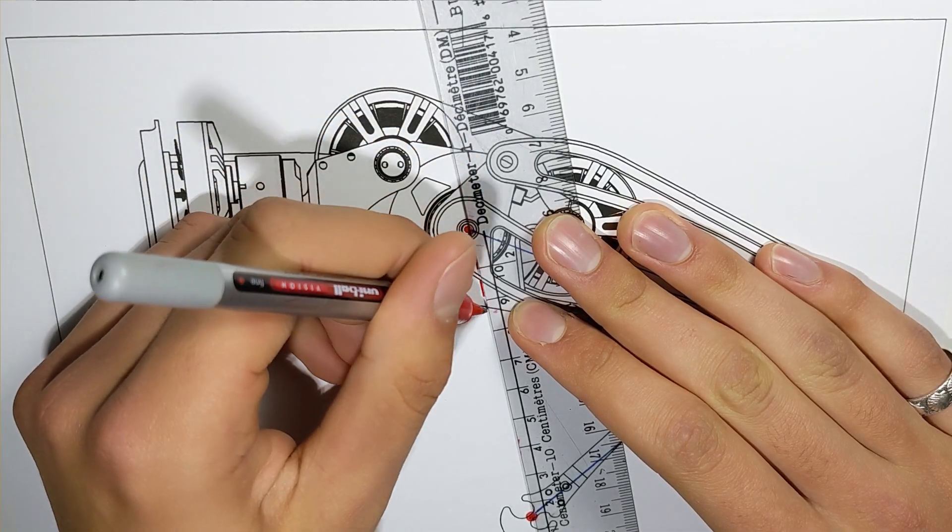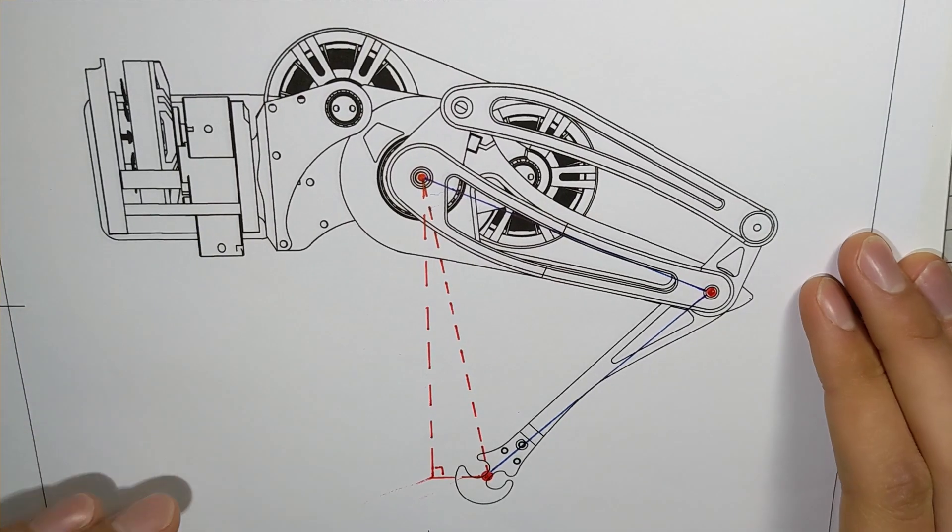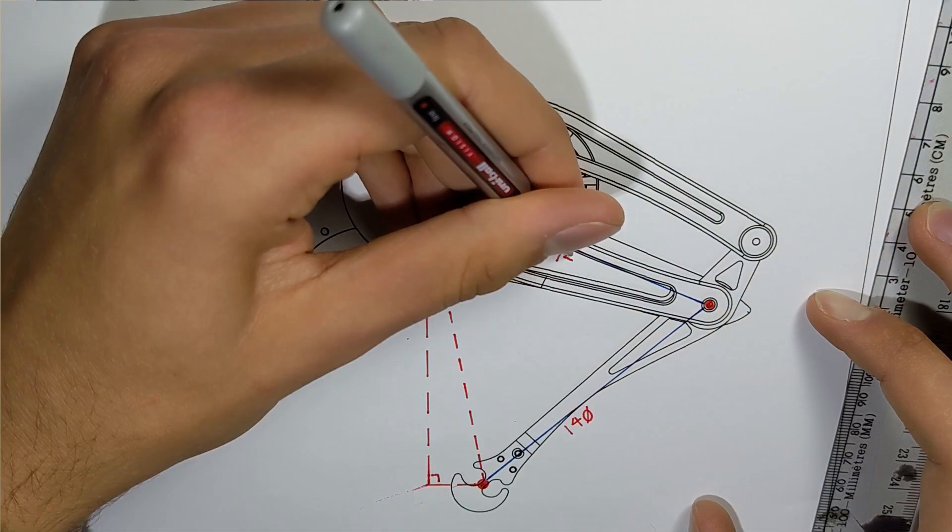Now, in order to make this leg useful, I essentially need to be able to tell the foot where I want it to go, and then in real time have the computer figure out what angles the three joints need to achieve in order to move the foot to that position in space. A methodology for solving this kind of problem is inverse kinematics, where we can solve for a joint position given a few known variables and some coordinates for the end effector. Thankfully, we can go about this using some plane trigonometry and avoid having to touch any crazy linear algebra. Let's just focus on the up-down Z axis and the forward-backward X axis for now. If we draw a few dotted lines, we can actually divide this leg into a series of triangles. And triangles are great because you can solve the entire shape even if all you have is one angle and the length of a side.